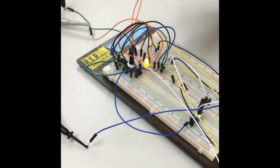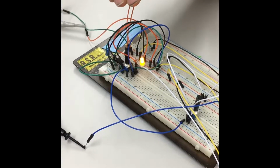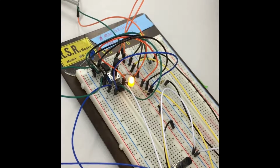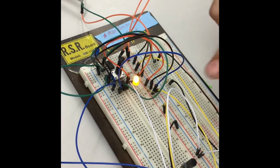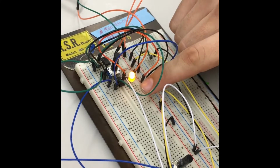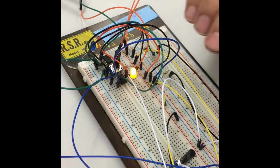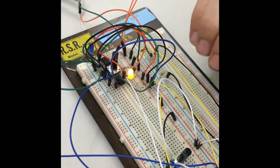This output passes through into a second op amplifier stage. This op amplifier actually acts as a comparator circuit. When the voltage reaching the comparator is above threshold, the voltage output jumps to V high and the emitting diode at the end is able to be lit. This indicates the lack of a pulse because the photosensor is able to produce a high enough voltage to reach this V high. Likewise, when the LED is off, the voltage is too low and indicates that of a pulse. This is then sent to an Arduino microcontroller for further processing.